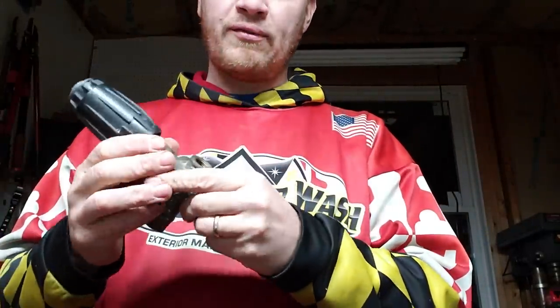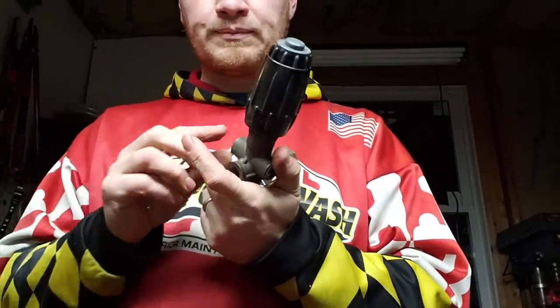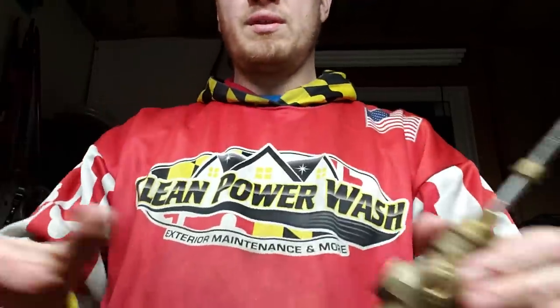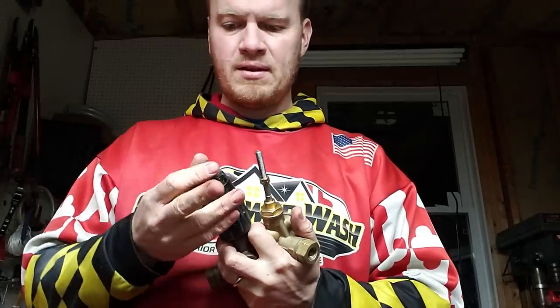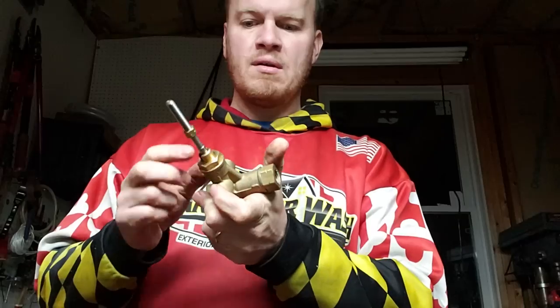You can take these apart. This part can be wrenched off. As we showed with this one, all you're doing is popping this part off, taking that nut off, and this whole thing comes basically straight off — it might need to spin off. Then you're left with the body and you can wrench that part off. Check that the ball inside is still good, look for trash, Teflon tape, a stone or pebble — anything that could be causing the issue. Unloaders go wrong for all kinds of reasons and there are rebuild kits available.